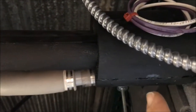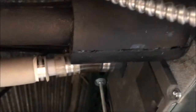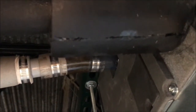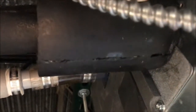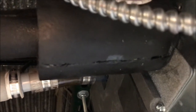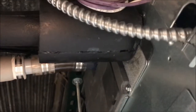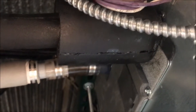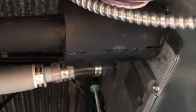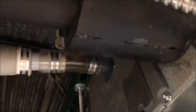The issue seemed to be with the flare fitting up here. I had taken off the insulation and cut it back. What I ended up doing was undoing the flare, checked it for cracks — we had a little pressure left on it, so I took the flare nut off, pulled it back, and checked the flare. Sometimes they get cracked, but it seemed to be alright. So I went ahead and put it back together and torqued it down. I know I torqued it down harder than when I pulled it apart, because I took it apart with the torque wrench and it didn't pop the wrench, so it wasn't as snug as it should have been. I went ahead and charged it up, put 40 pounds in there, and it's running. I did a soap bubble test — it's in heat mode so it's got a lot more pressure on the suction line right now — and I got no bubbles, so I got it all glued up with Armaflex glue.